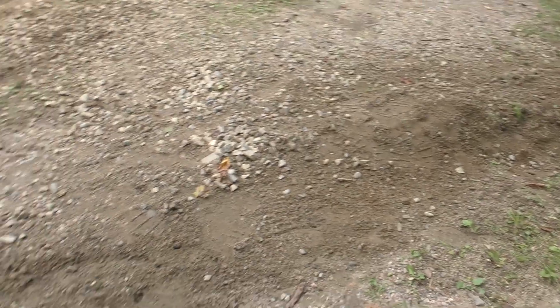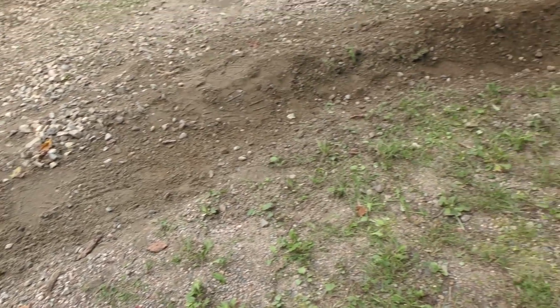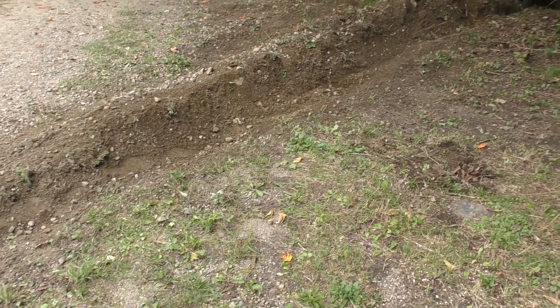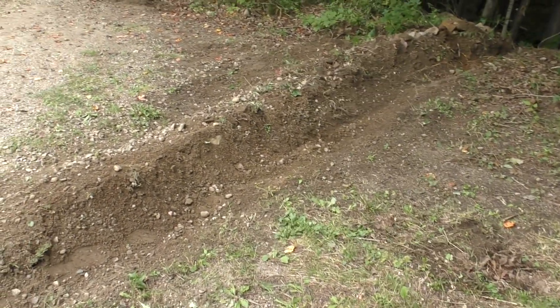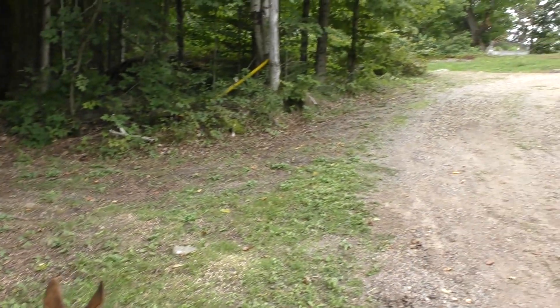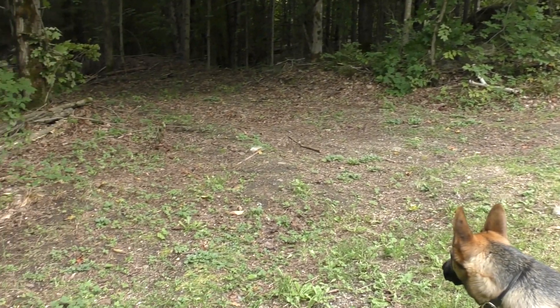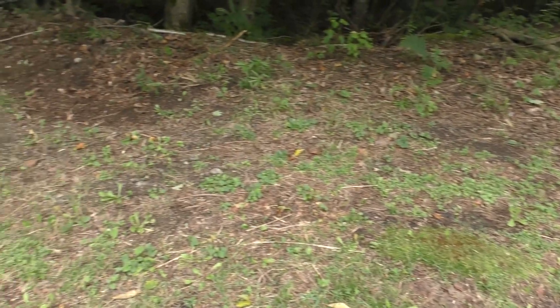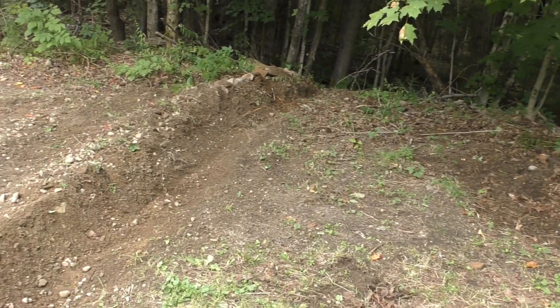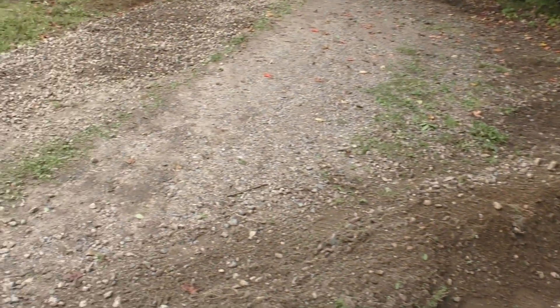And the same thing here — you can see this is where the water starts to dig into the driveway. So I've just dug away a little bit and built a berm there, put some rocks in and some gravel, and then just pulled the soil over the top. I'll be sodding that in or seeding it with grass. The water comes down the driveway, goes over towards the trees, pools in there, and hopefully I'm going to catch all of this in this berm and it will just wash over the edge of that embankment and away into the swampy area of the property.